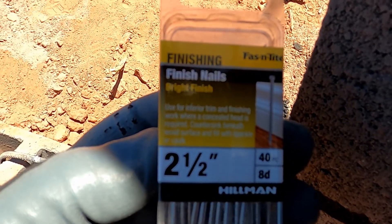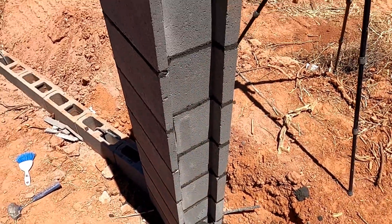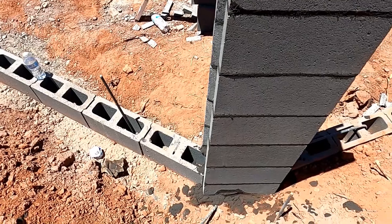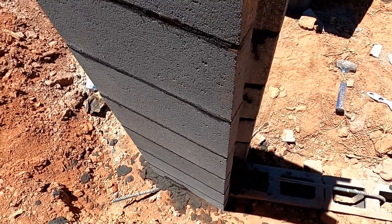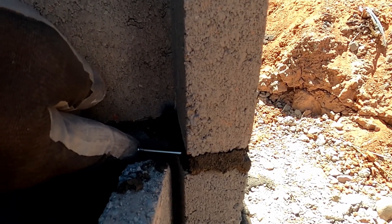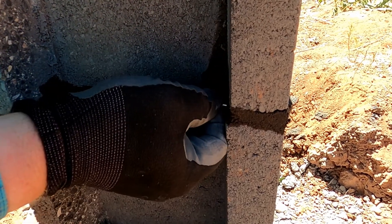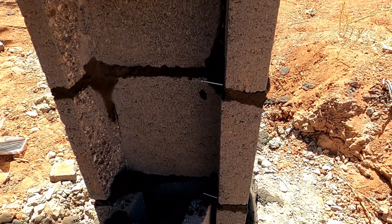These are two-and-a-half inch finished nails you can buy at the local hardware store — that's what we're going to use for our double lead 45-degree. So we've got a wall going at a 45-degree angle going that way and that way; technically it's a 22-and-a-half degree angle. We build a single column like this and then just stab these nails in. You stab your nails in like that, push down so the nail is to the top of this block, shove it in far enough that when it dries it'll hold good. Put the other one in like that. If you go back in too far on the angle, your block will hit here before you can get to the string, so put it about the center.